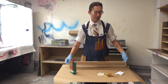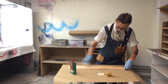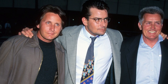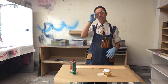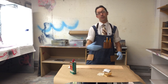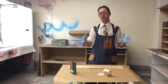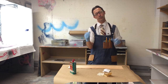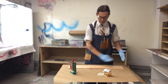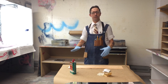So I've let that dry for about 10 minutes. I'm going to come back with my dry rag and wipe this down. I really want to wipe all the excess off so it has a similar sheen right the way across. Now I really want to let it sit and dry for a while — probably four hours, maybe more if you've got the time. I usually like to hit it with about four coats total. From coat two to coat three, and coat three to coat four, you want to let it sit about four or five hours between each coat — that's a good solid day. I'll scuff it out between each coat, lay another coat of oil on, let that dry for about 10 or 15 minutes, then wipe off the excess.